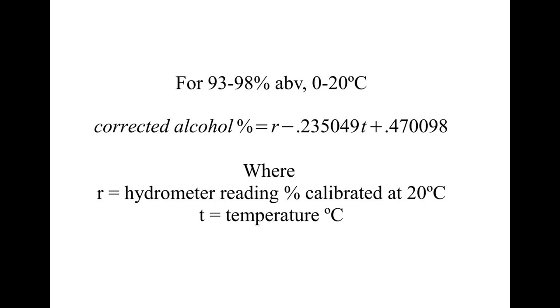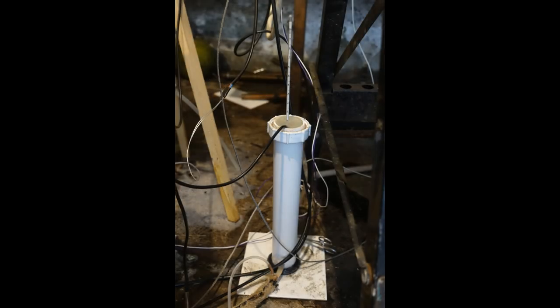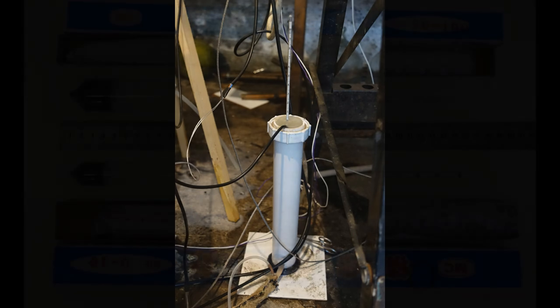Continuous distillers also want a second parrot to monitor the alcohol content of the bottoms, which are being discarded, to help minimise the amount of precious alcohol that's going down the drain. Here things take another step up because the change in density of an alcohol-water mixture is significantly less per percent alcohol at 1% than at 95%. Hydrometers intended for the low concentration range have to be more sensitive than for the spirit range. That makes them larger with narrower necks.